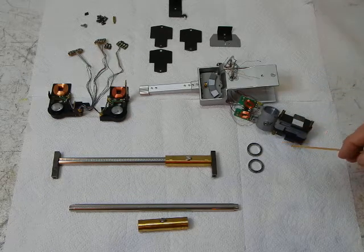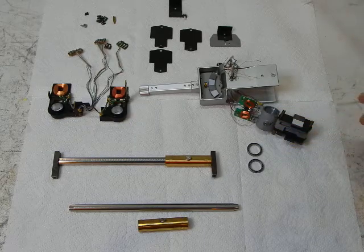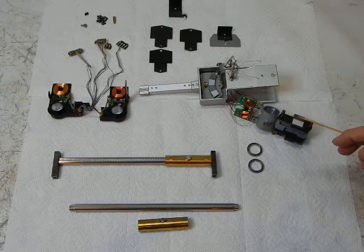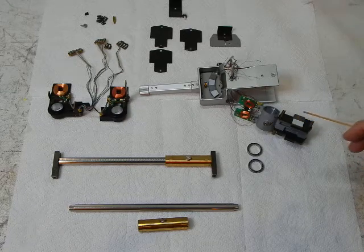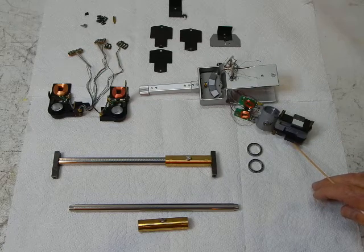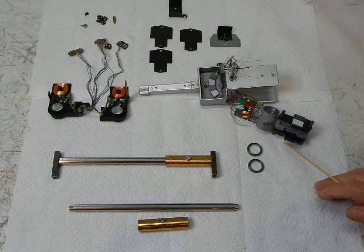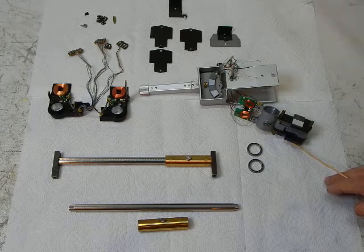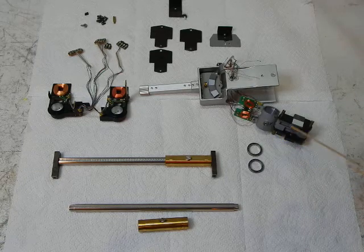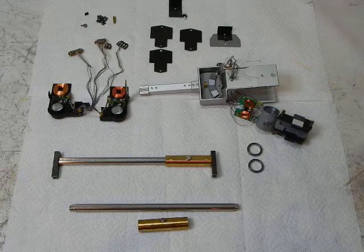The next thing is this assembly. We have magnets on it. This is the drive magnet for the vertical movement of the tone arm. And this is the detection magnet for the vertical positioning of the tone arm. Any position and velocity information needing to be sent to the microprocessor originates from these magnetic fields, and those fields induce currents into the coil and into the Hall effect sensor.